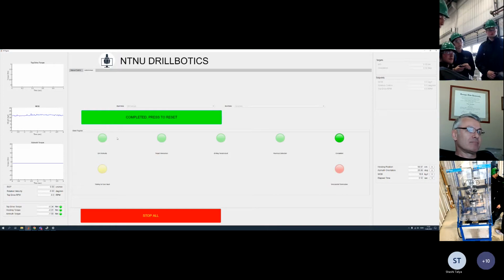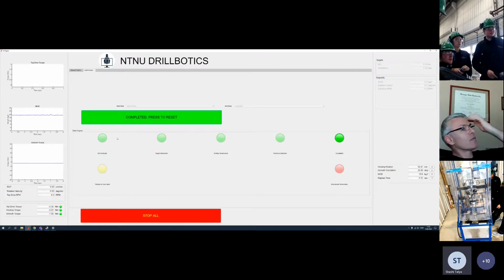So the only calibration point we're doing is actually exiting the rock, either on the sides or on the bottom of the rock. Yeah, so we kept the azimuth fixed, and then we were just building until 30 degrees, and we measured a horizontal displacement of around 11, 12, 13 centimeters. We measured 12 centimeters, and it should be 13 in order to reach 30 degrees inclination.